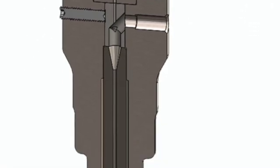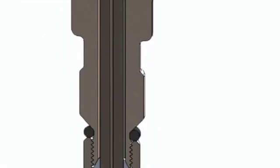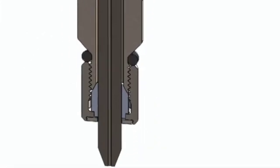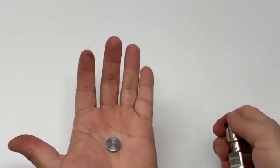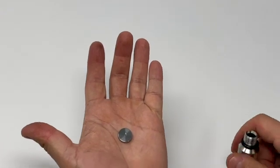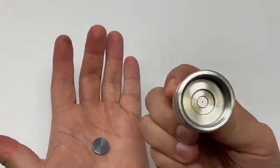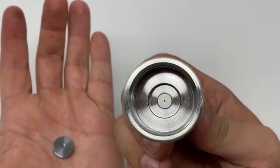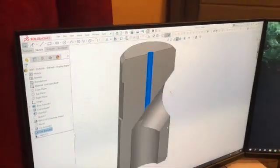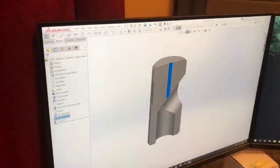However, that is where the similarities end. The Precision Core 5 features a removable diamond, which allows users to periodically inspect the carbide mixing chamber below. The mixing chamber is replaceable, and we encourage users to change it about every 600 hours to maximize the life of the diamond. The mixing chamber is really the secret inside the Henco lineup of diamond cutting heads.